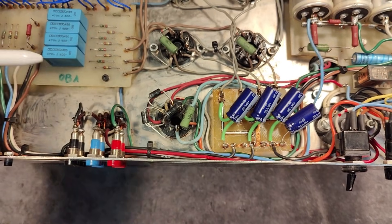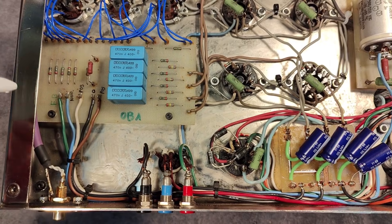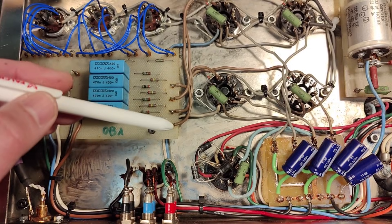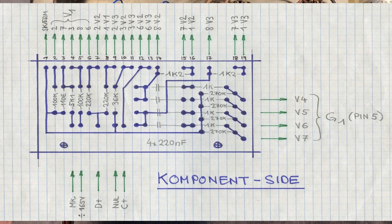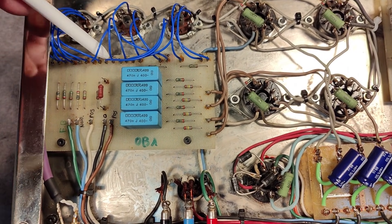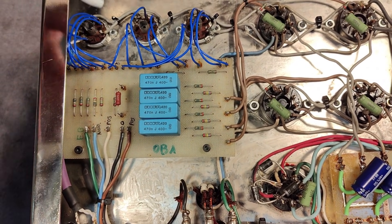You can also see this little circuit board. Instead of pure point-to-point wiring, they made a nice small PCB. I have all the documentation and schematics, including a sheet showing how the board is laid out and how everything connects to the three signal tube sockets. I like the approach of numbered wire connections at the end of the board going to the tube sockets — it keeps things orderly and prevents mistakes.